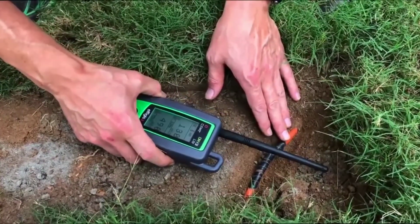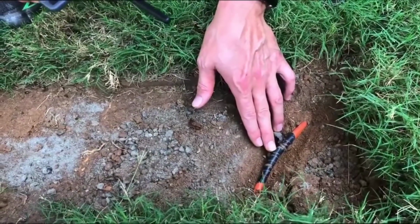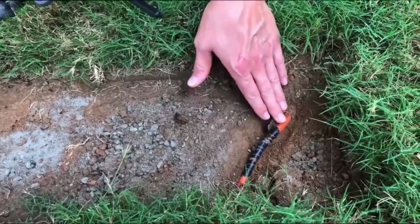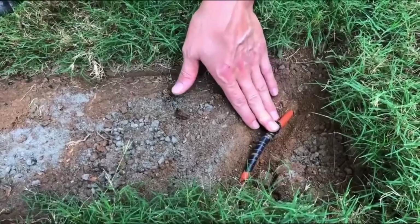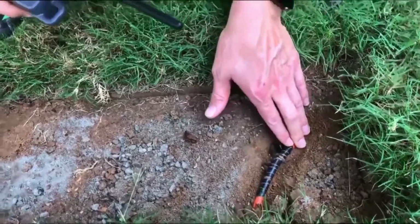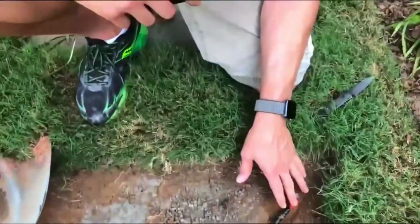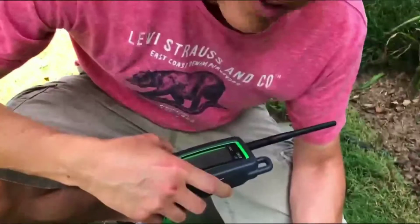Obviously, holding the leakage meter on here, we're seeing very high levels of leak. Electrical tape is not going to be water sealed. It's not a proper fix for this coax cable. So we are going to need to have a new drop put in here, but this is clearly the reason for the micro reflection, the reason that this modem is likely red, and this is not a proper field repair. So this is the reason we're having issues on this particular home.